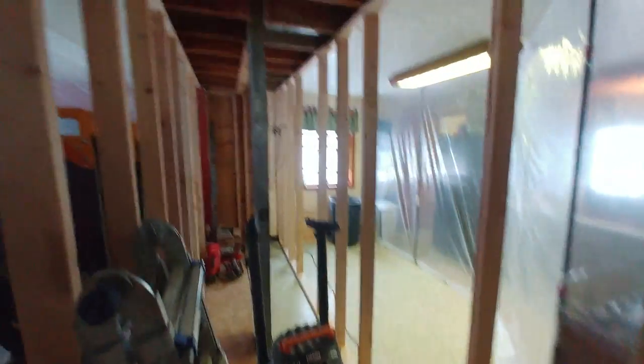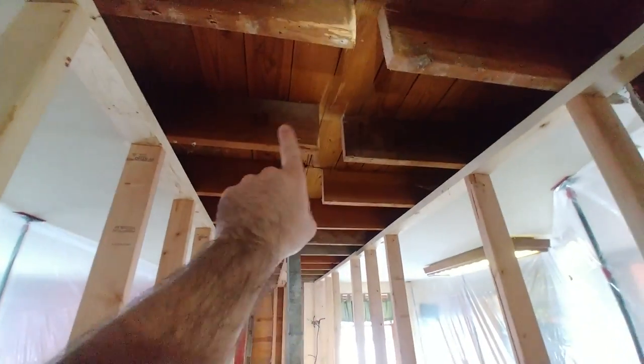So now I've got myself a surgical cavity removal without disturbing the wall board or any of the other framing, and without punching out through the wall into the stairwell or the closet. It's almost ready for the beam — I'm going to find roughly the middle of the span where the beam needs to go.